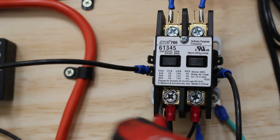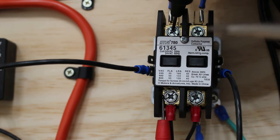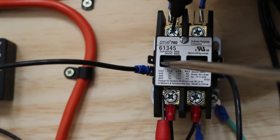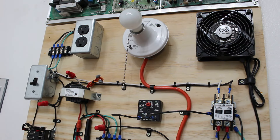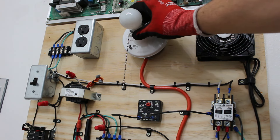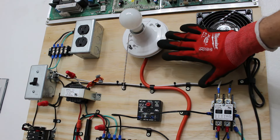The same for the other side. We put one lead here and the other lead here. Once the coil is energized, this plunges in and creates contact from here to here. Right now they're not touching. We act as if the coil is energized and plunge it in — now we have contact. Keep in mind, this side is separated from the other side. In this case, this contactor controls our cooling circuit — specifically our compressor and condenser fan motor, which would be our condensing unit.